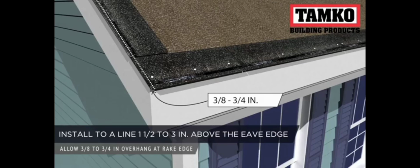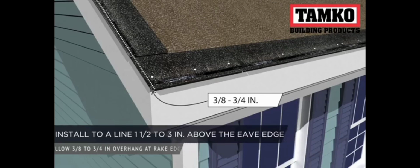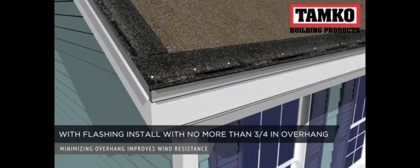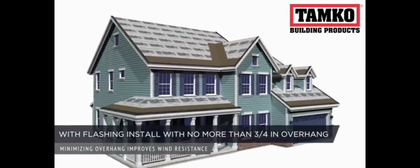When installing along the rake edge, allow 3/8 to 3/4 inch overhang. Where metal flashing is used, install the starter shingles even with the drip edge, allowing no more than 3/4 inch of an overhang. Minimizing overhang helps improve the wind resistance of your system.